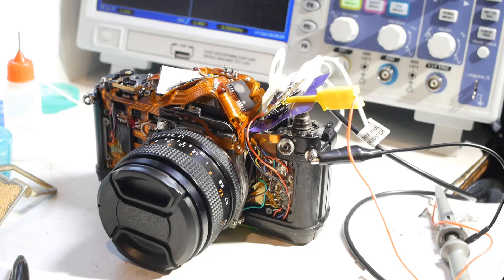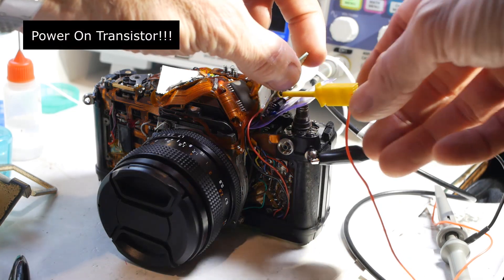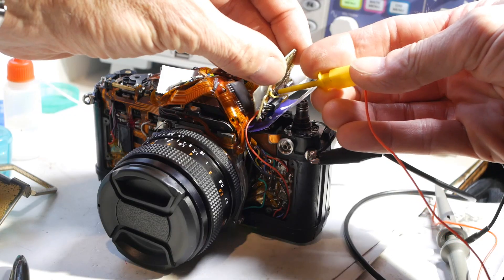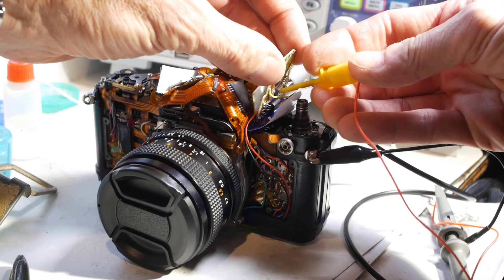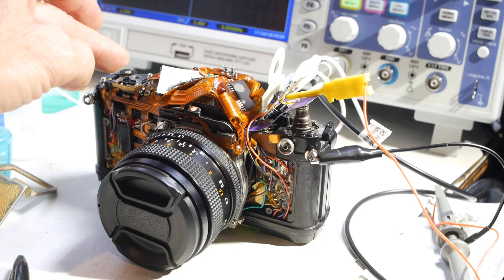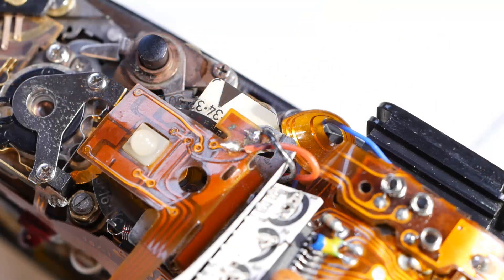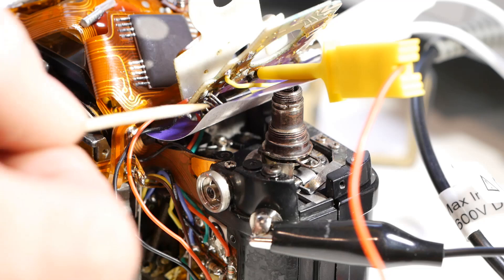Well, I wish I'd been filming that. After I repaired that last broken track, I tried the camera again and it was still dead. So I began probing the power-on chip and the voltage regulator for signs of life and there was nothing, until I moved the PCB again to clip onto a different point, and all of a sudden the camera started working. Foolishly I moved the probe back onto the voltage regulator and now the camera is dead again. But I got as far as testing the single wind, continuous wind, and the self-timer, all of which worked. I shot 34 shots according to the frame counter, so now I'll go in search of another broken track somewhere up here.